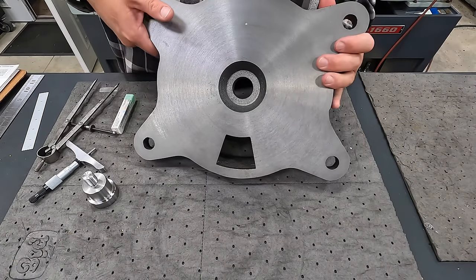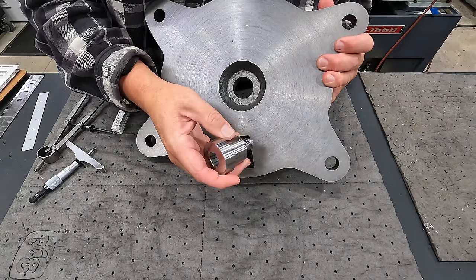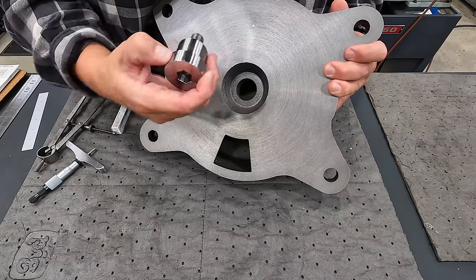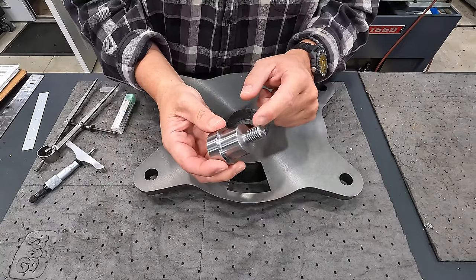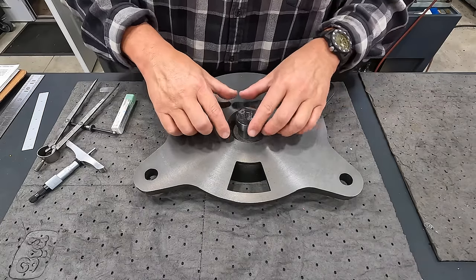To give you a reminder, we've got our swivel bolt that we machined on our Miltronics, and that goes through this bore right there. And what we need to do is take about 50 thousandths out of this face right here, because the swivel bolt needs to tighten down onto this shoulder right here, not this shoulder. You're not pulling this down to where it's tightening up against this.